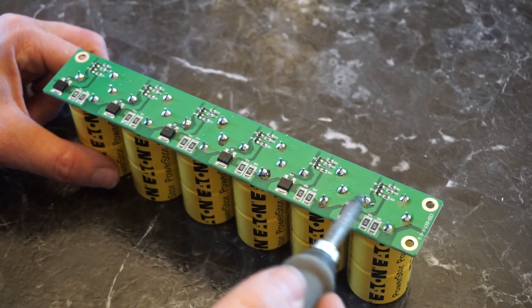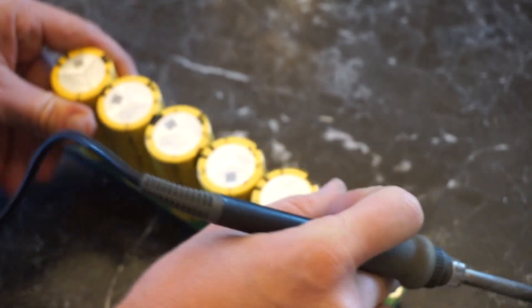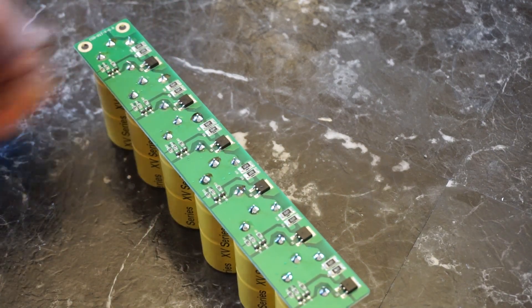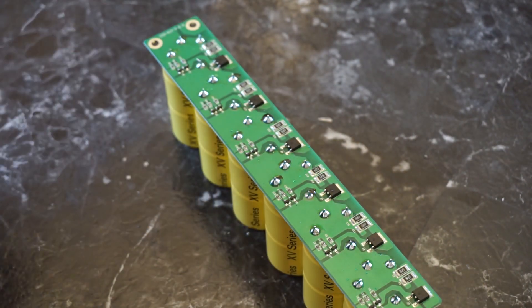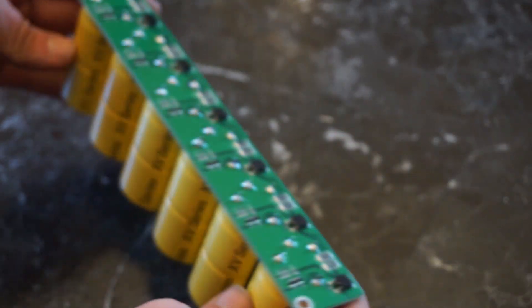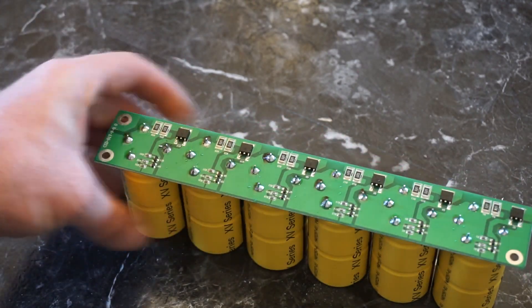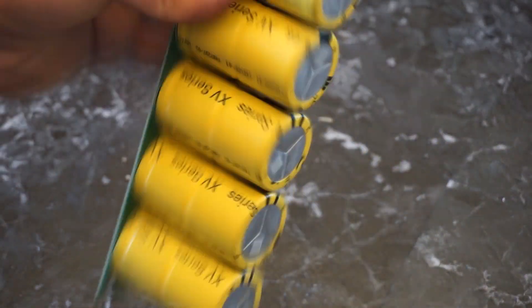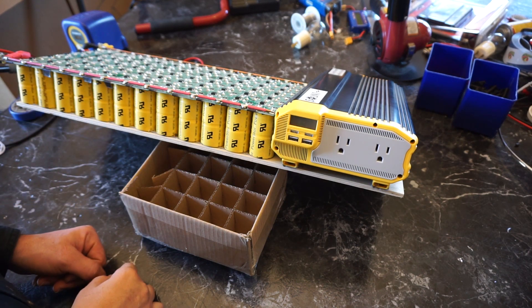Okay, that's it. You want to check and make sure you didn't miss any solder points, but that's it — very easy, very fast. You end up with a nice boost pack with nice terminals where you can connect wires with ring connectors. To charge this up I just connect it to my 30 volt power supply and charge it up to about 14 volts, and then it can be a direct replacement in a lot of 12 volt systems for experiments. That's the assembly of the balance board with these power store supercapacitors.